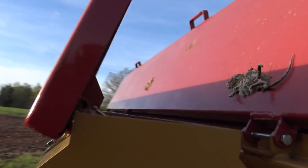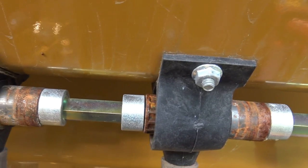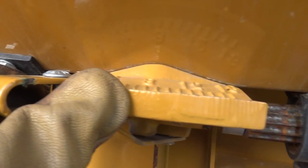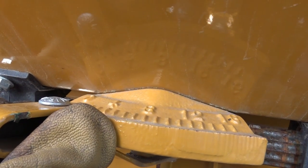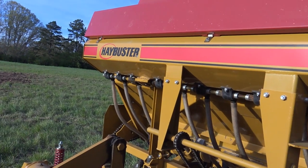The rear hopper is a little different — it's for clover seed, a smaller seed. The seeds are caught by a little gear, and there's an adjuster you slide left to right; however much gear is exposed tells you how much seed goes down. We're going to take it all the way to zero and barely open it to one. There's another one on the other side — this is two separate compartments — so we repeat this process and tighten the little wing nut.